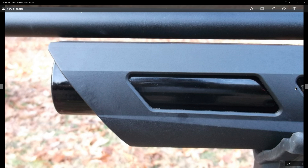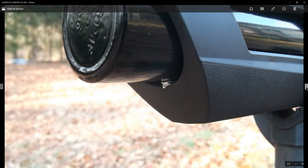One of the things that people said they hated most about this weapon is that every time the barrel was nudged, the shroud would change the point of impact. My resolve was I created a shim on the front side here temporarily to see if it would work to hold it down. Then what I did was 3D print an insert that went inside here, went underneath the tank, and sat down into the bottom of the shroud and gave it support. It worked perfectly.